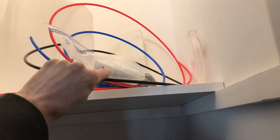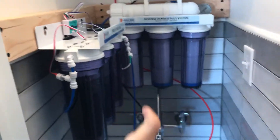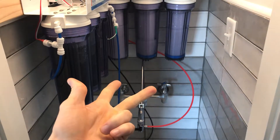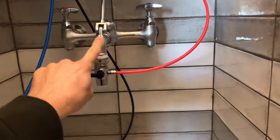These are the sensors — all of this was done for you. So when you get this unit you're going to have the main unit in one box, the sensor box in another box, and then a bunch of spare tubing which you'll use some of. A lot of it is just extra. In RO systems, red is always going to come from the tap — that's your dirty water, black is the wastewater, and blue is the clean water.